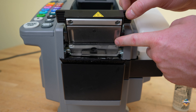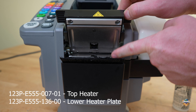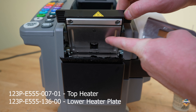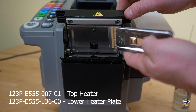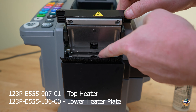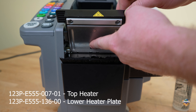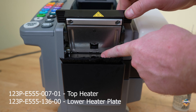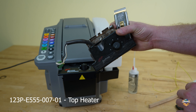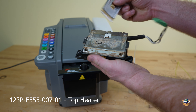Another good place to check every so often for buildup and dirt is the underside of your heater. This lower heater plate should be able to snap off the underside of the heater. Any buildup that you see on this heater plate, we use a window scraper and scrape the bottom of this plate. It's also good to check your lower heater plate for any pieces of tape or debris stuck on it. Any buildup on this plate or the underside of the heater will create a lip that the tape can catch on and cause more jams. Here's a broken heater that we've taken off the machine in service — this is the type of buildup that you'll see, and you can just scrape all that off.